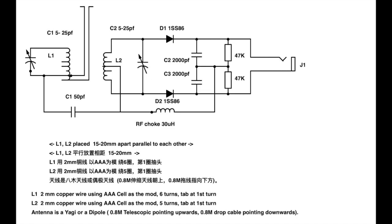There is an RF choke, 30μH, which is required to insert in the circuit to filter out all the radio frequency signals, so we have only the audio frequency signals. The capacitor, 2000pF, provides a similar filtering function, so only audio frequency is allowed to pass through.